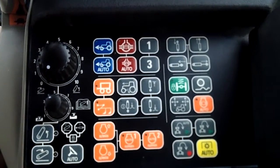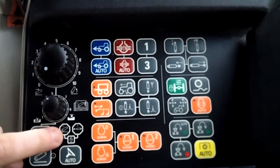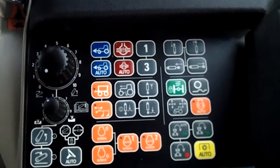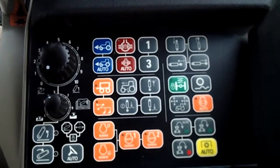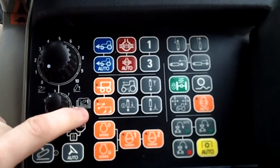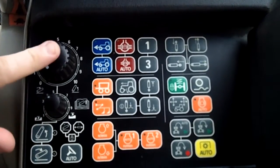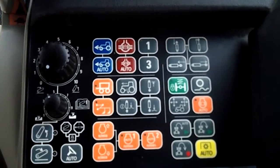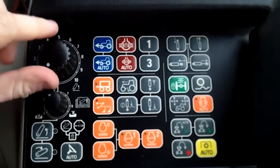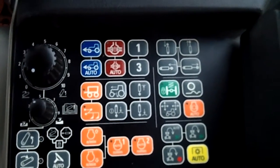Next is auto guidance and engage right there. You've got your stop signs — so for your three-point hitch that's locked out, or for your remotes that are locked out, that's the stop signs right there. This light can come on if the hitch moves via these buttons or the fender buttons and this hasn't moved, so it means they're just out of sync. If you cycle it, it will capture it — it's called hitch capture.